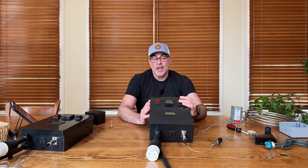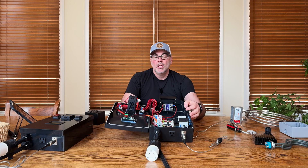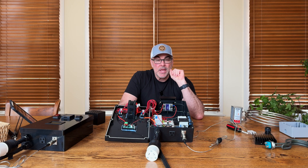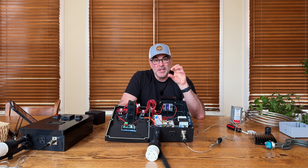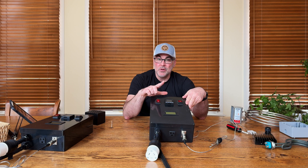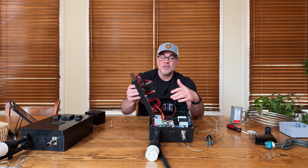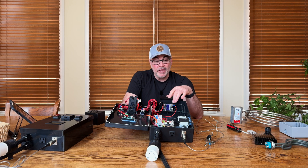On the front of my control panel I have an on/off switch that goes to my electrical element. When this is on, it turns on the contacts in my contactor that sends power to my solid state relay. A solid state relay is a switch much like a contactor, but it's able to turn on and off power very quickly, so it can send power to my electrical element and reach precise temperatures using the PID. The PID sends signals to one side of the solid state relay that turns on and off the power side, which sends power to the electrical element.